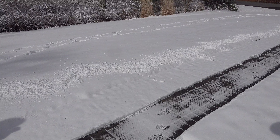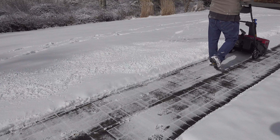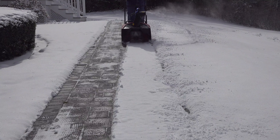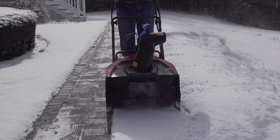This next test looks a bit like a joke — it's only about an inch of snow on my front walk — but it's telling you more than you think. A normal snowblower cannot move this little snow because the tolerances are so loose. This machine is pretty tight and it had no problem at all scraping this tiny amount of snow and moving it right out the chute.